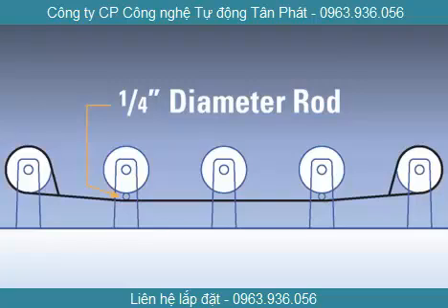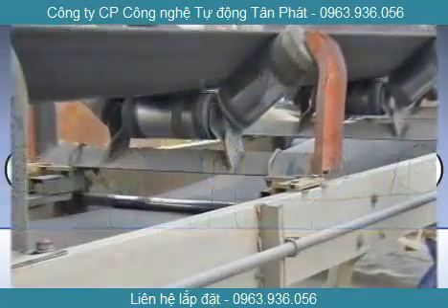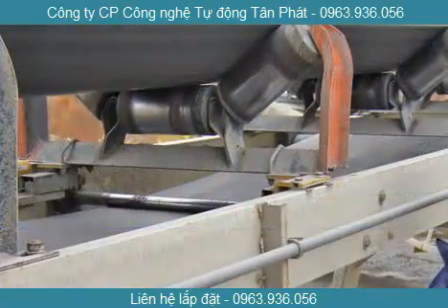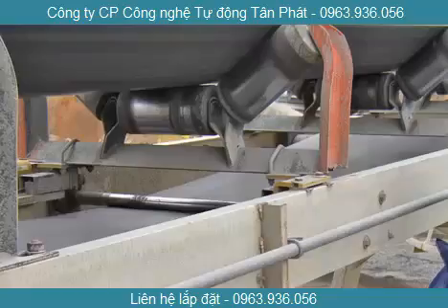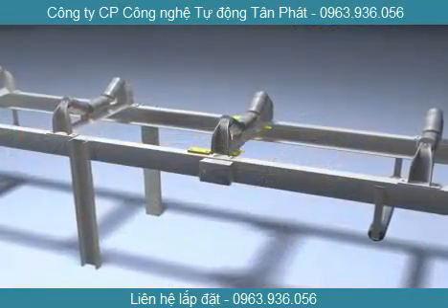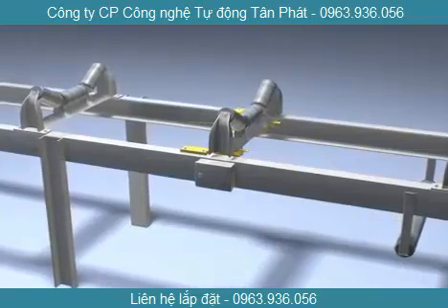Using the string as a guide, proceed to adjust all idlers in the scale area to within 1/16th of an inch. Idlers can be adjusted by placing flat washers or bar stock beneath them, holding the shims in place with the idler mounting clips. Be sure to recheck alignment after installing the shims. As a precaution, do not pry or shock the load cell when lifting or adjusting the scale weigh idler.